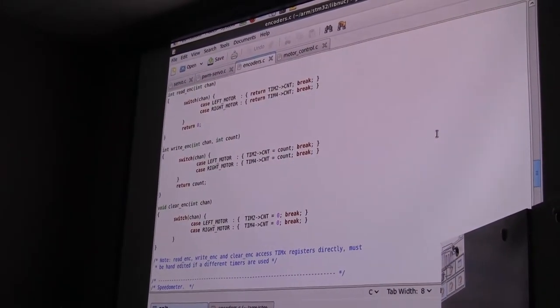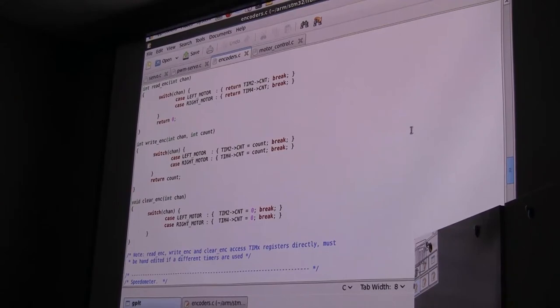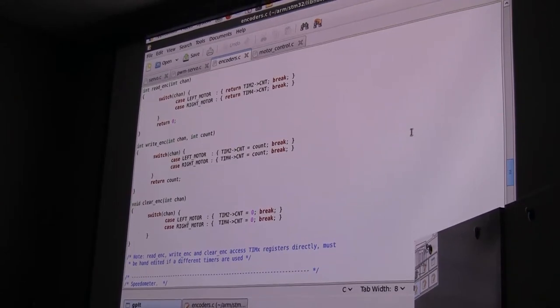So what this gives us basically is, when you initialize those and the encoders move, there's a pair of quadrature signals that are 90 degrees out of phase with each other, so it knows both the direction and how many counts it went. We need more than just counts, we'd like to actually know velocity, and I get to that in a minute.